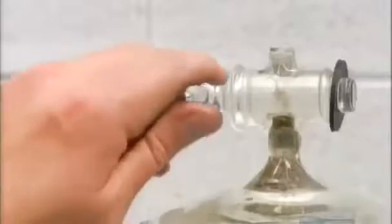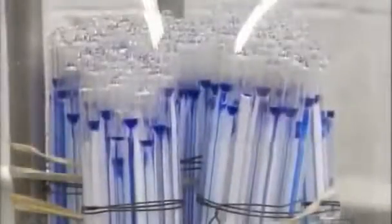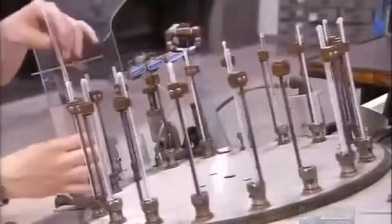They cool the welded glass and wire on a conveyor. Next, they turn on a vacuum pump for several hours to pull the air out of the wire and tubing. This draws the blue liquid wax up, but this time it's not a test. The wax is a non-toxic alternative to mercury that will expand and contract with changing temperature. The thermometers now travel through chilled alcohol, shrinking the blue liquid down to the closed end of the thermometer.